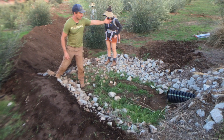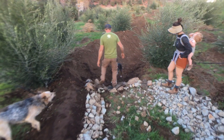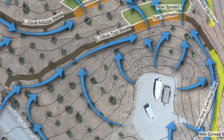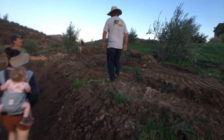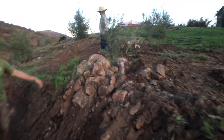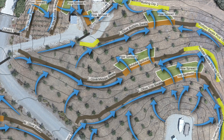We took soil from this zone knowing that in the future they'll have a ranch tractor to drive in, scoop out silt from heavy siltation events, and use it for gardening or orcharding. From here the water transitions down another big stone sill into the bottom of the east olive top swale, running almost 300 feet out across the landscape around the next ridge. We had a lot of native rocks on site, so we didn't have to bring in any rock material for all the armoring — it was already here. These were boulders Wes had to dig up on the excavator, and this section was very slow going — about five feet per hour.